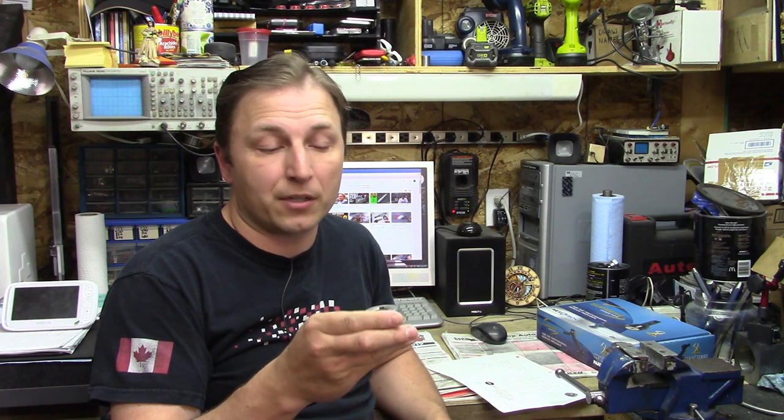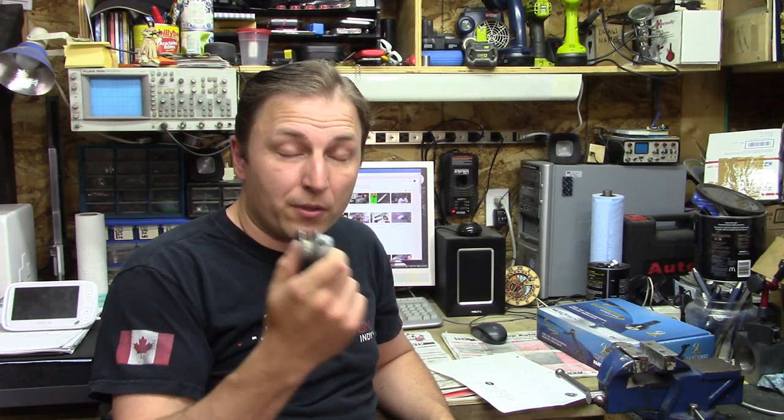So that's what I've been up to the last little while, and needless to say the Shaper kind of got put on pause for a while. We're now back at the Shaper, and what we need to do now is make the pulley to go on the motor. The pulley that came with the motor was just a single groove hardware store variety one — the motor's not original. The original was a 440 volt three phase unit; this one's 125 single phase. This is close to the right size for the low speed, but I want to have both speeds on the motor because I have both speeds on the transmission, so that gives me the four original speeds.